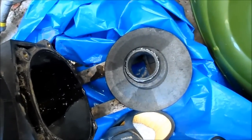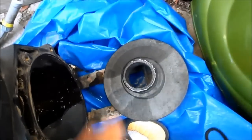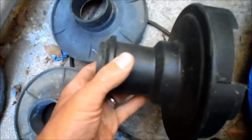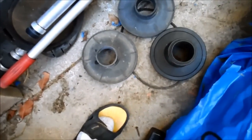You might have your pressure down below 10 on your filter and be wondering why it's not going up — that's because the diffuser is melted or damaged. Make sure you get the exact diffuser for your pump when you replace it. They come in different sizes for different pumps, and the same pump may have two different ones for different horsepower, so that's very important.